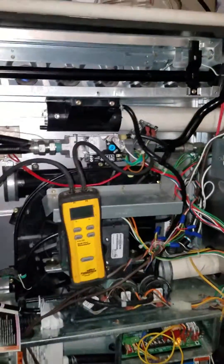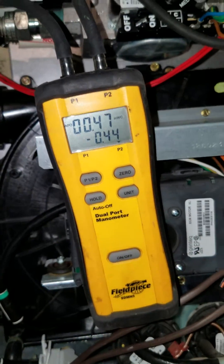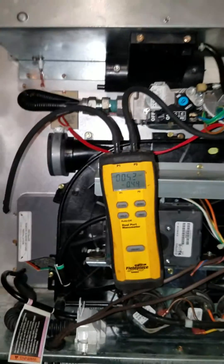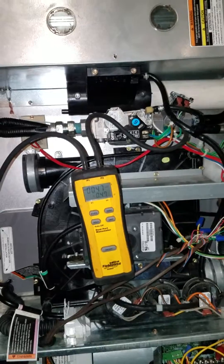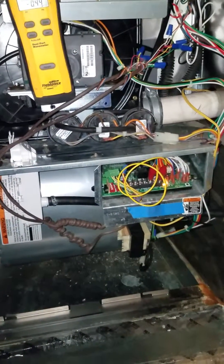Maybe we should leave it running just like it is. I'll put the burner box on so you can see what it looks like. So I just put it in place — it's now pulling vacuum through here. So it's not going to be as accurate, but you can see that it drops some. If I open it, pressure goes up; close it, and it goes down. That's all I got. When we're done, you will put your screws back in and put your caps on. By the way, putting your caps on changes your gas pressure too, so leave your caps off while you adjust. Get it all precise, then put your caps on. Then take my jumpers off and put the green plug back in.